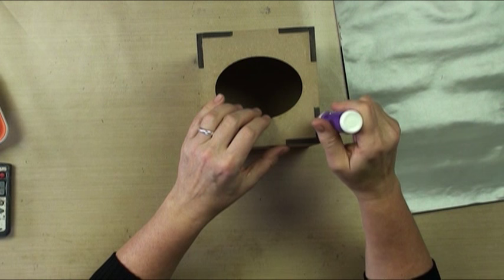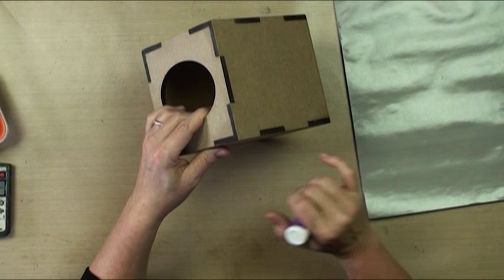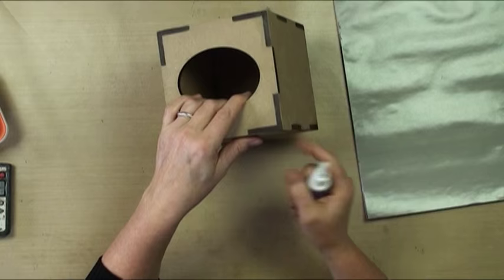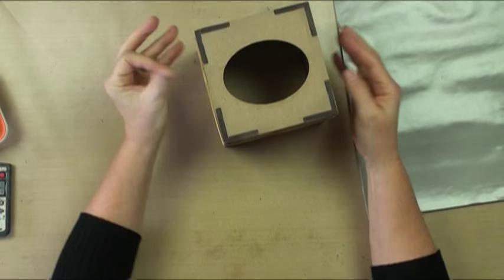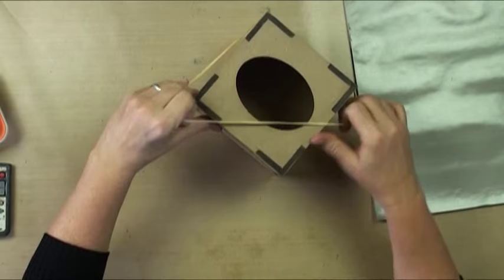I put a very flat bead on the pieces that touch wood — you put glue on this piece and on this piece over here on this side. Just look at where things will overlap and glue those. Don't put too much, and have a paper towel ready to wipe it off. You're not going to be staining this, so it doesn't matter if you have some glue smear. After assembling, secure it with a rubber band. This one self-squares because once you put the top on it will be absolutely square. The rubber band just keeps everything from sliding apart.